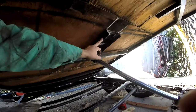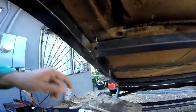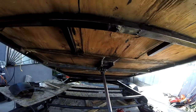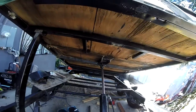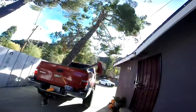Sorry, I forgot to do some recording in between — I just got caught up in the work. I welded this piece to this piece all around when it was off on the ground, had my girlfriend help me put this piece up, and then welded all around on this side and that side. Attached the cylinder back up. It already looks much more sturdy and strong. Now I just have to put one more bar right here, weld to the front, one more in the back, a couple supports, and do some tack welding on those hinges. Let me cut the next piece of material.